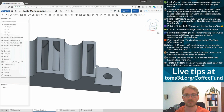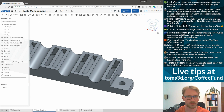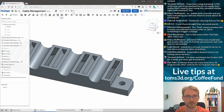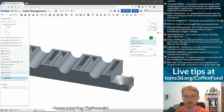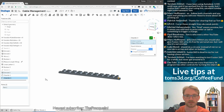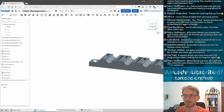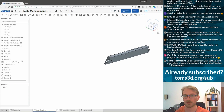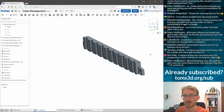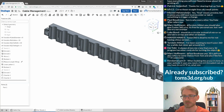Chamfer up, chamfer down. And because this is going to get countersink screws, we are also going to add a chamfer on the top right there. Maybe not that much, but like a 3mm one. Perfect. So I'm guessing at this point you are seeing how this part is supposed to be printed like this, so that we get these internal sections printed nicely.